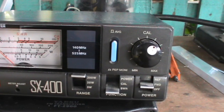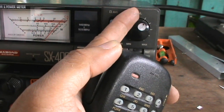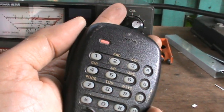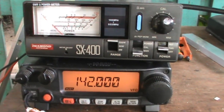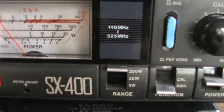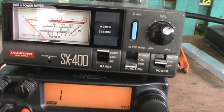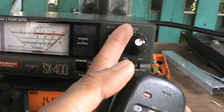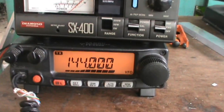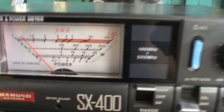Let's quickly check 142 MHz. Let's calibrate. We have 142 MHz — switch to SWR mode, we have 1.4 or 1.5 SWR on 142 MHz. Let's check 144 MHz. Let's calibrate. We have successfully calibrated. Move to SWR position and press PTT — as we can see we have 1.2 SWR on 144 MHz.